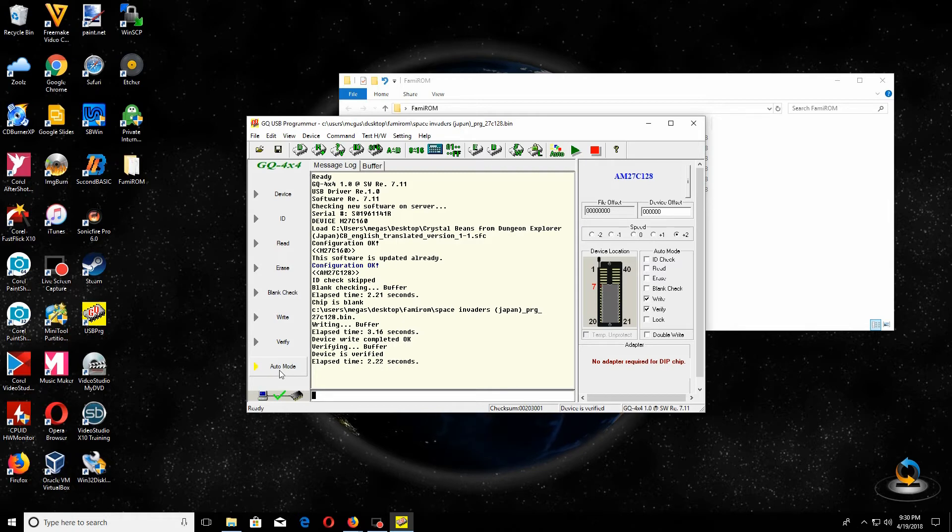Now, immediately, we need to block the little window of the UV — of the chip — with tape. Otherwise, it will be prone to damage because of the UV light. Right now the sun is down and it's nighttime, so I'm not too worried. What I am going to do is take out the chip, label it as PRG, which is the file we burnt, and now put in a new chip of the same type. The next one is CHR — I'm going to put another one in. Make sure it's aligned perfectly, otherwise it will not work.